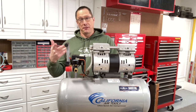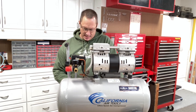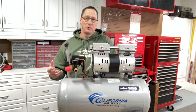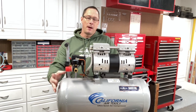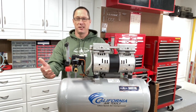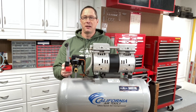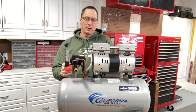The reason I have it on the table is to answer that question. It's California Air Tools, and specifically the model number people ask for is the 8010. We chose this one for portability to take to shows. It makes 2.2 cubic feet a minute of air at 90 PSI, has an 8-gallon tank, and uses 110 volts at 8.5 amps, which means I can run it on EAA's power out in the middle of the field on a drop cord without any trouble. A lot of compressors use a full 15 amps and blow breakers when you get out in the middle of nowhere like that.